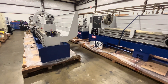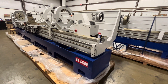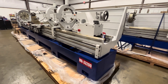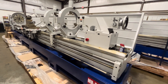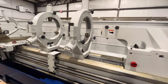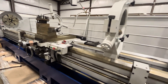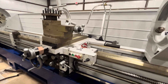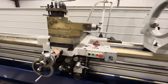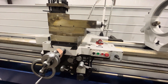Then we continue to look at our next machine, which is actually 40 inches longer — MB 33-inch by 200-inch center distance. We take a quick look and you can see a heavy-duty steady rest, optional two of these. You can see how heavy they are. Then there's the four-way tool post, and the machine has a control station on the right-hand side of the carriage. It comes with a rapid motor, so you can have four-way traverse with rapid.